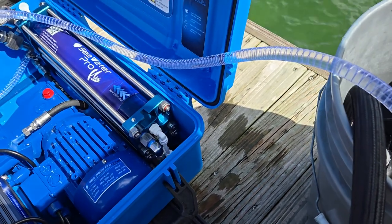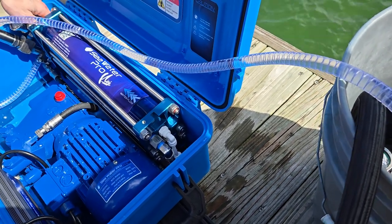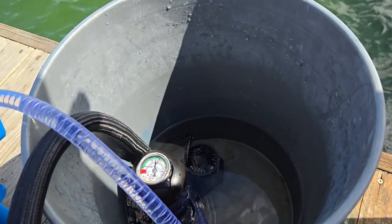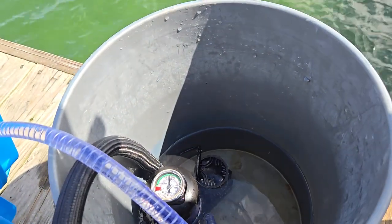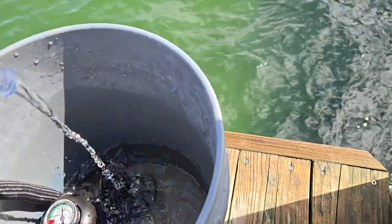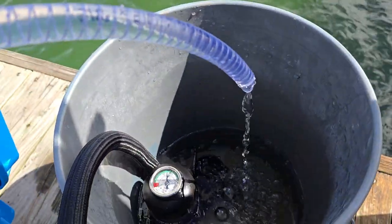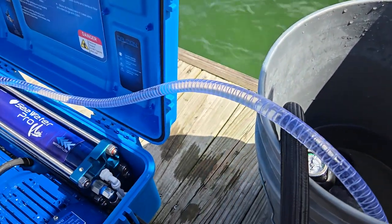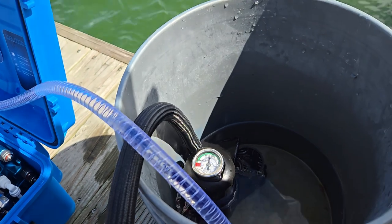Because these are dry membranes, they're a higher quality membrane than the wet ones but require a pre-soaking. It's a very simple procedure: we're just recycling water for a few minutes, then we're gonna turn it off, leave it, let it sit for a few hours and then go ahead and use it.